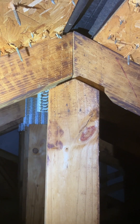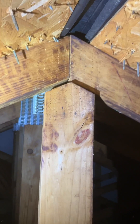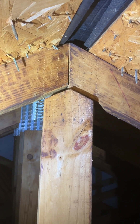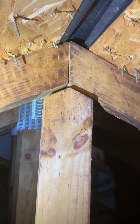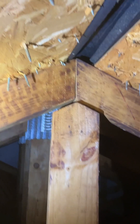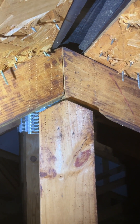It is now loose and has dropped down about a quarter of an inch. Loose gusset plates need proper repair to prevent components from coming loose, but if the gusset plate becomes detached and you only have one, you run the risk of it popping completely loose like this web component did. That quarter inch drop means the ceiling below has dropped about a quarter of an inch in this area, which puts additional strain on the trusses to the left and right.